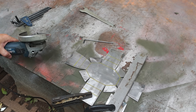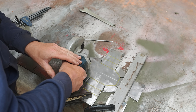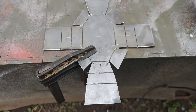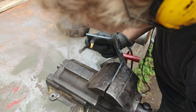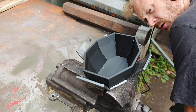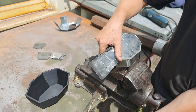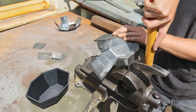Those errors would potentially cost a lot of time in an already very lengthy process. After scribing all the parts carefully, I used an angle grinder to cut grooves where the metal needs to be bent — this is probably the most imprecise step in the entire process. Luckily, I have many years of experience handling angle grinders and that helps with a steady hand. The grooves must be deep enough to allow the metal to be bent by hand, but not so deep that the steel will easily break while bending. Each of the two molds could have been made from a single piece of steel, but I made them from five pieces each because it's easier to clamp the sheets in a vise and bend the parts precisely. One weakness of the plasma cutter method is that cuts are about two to three millimeters wide and it's not possible to completely compensate for the material lost — we will have to fill those gaps by welding over them.